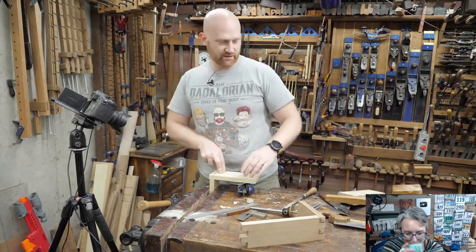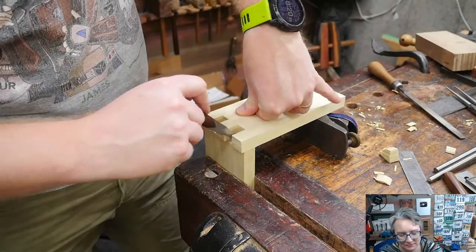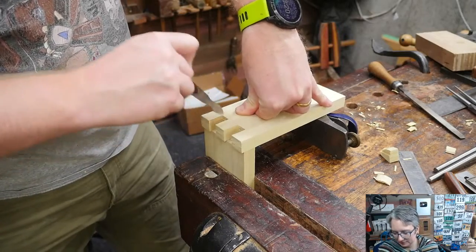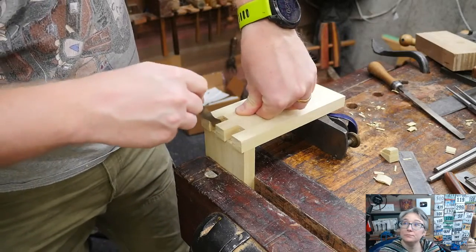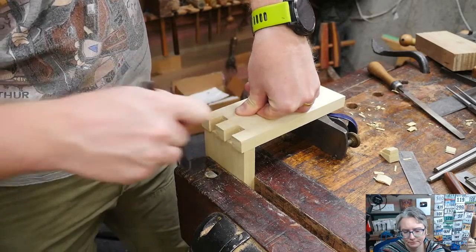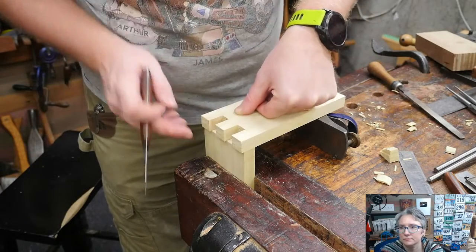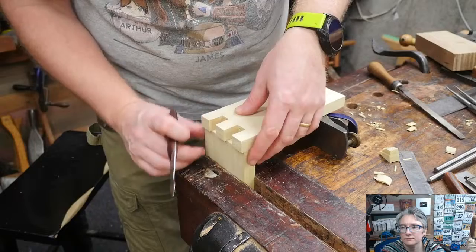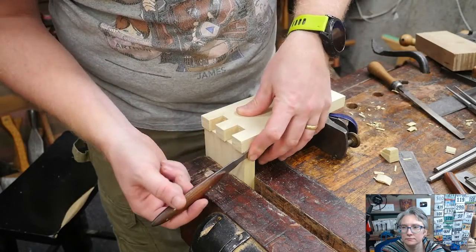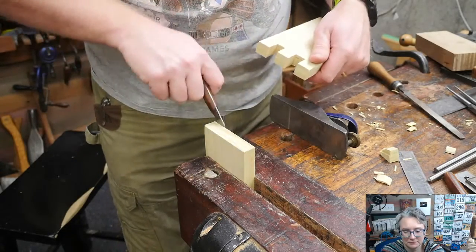So we're going to set this on here, and I'm going to grab my good marking knife and do exactly what I did before. Light, medium, hard, light, medium, hard. And when I line this up, I'm eyeballing down in here, and I want to see that the back of this is right on the edge of that board. And then I'm also going to be feeling the outside edges here, because the important thing is that the bottom or top, whichever is your reference, is flush here, and then that the back of this is flat